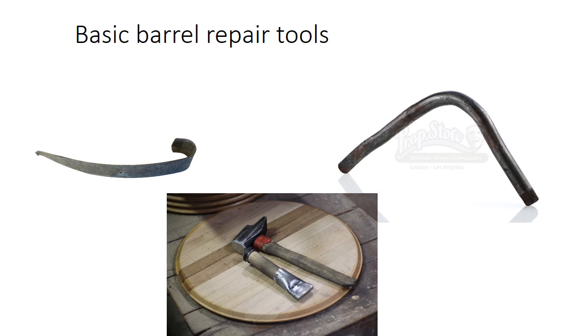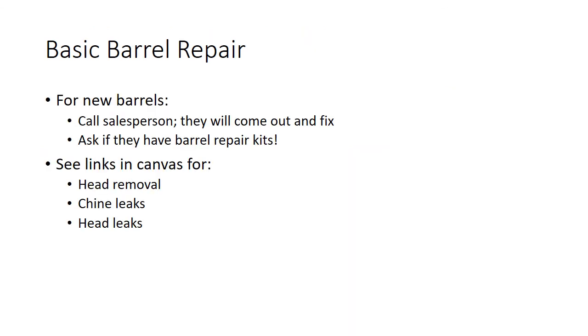Then there's a little bent pipe. When you can't get that head in place perfectly, you can take that pipe and put it through the bunghole, then pop the head from underneath — that'll help pop that head in place. We call that a bump, just to bump the head up into place, because very rarely do you ever pull that head right in place perfectly and get the hoop set in time.